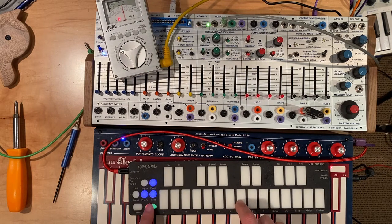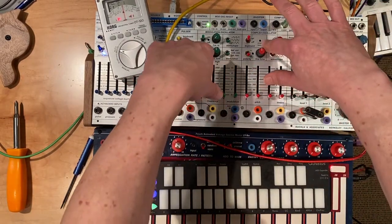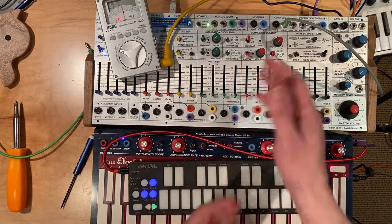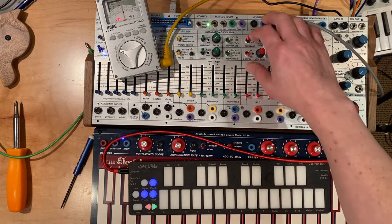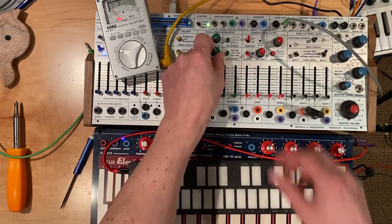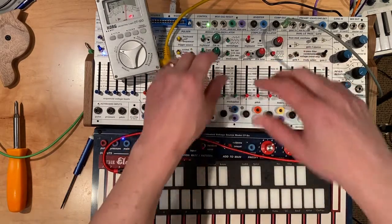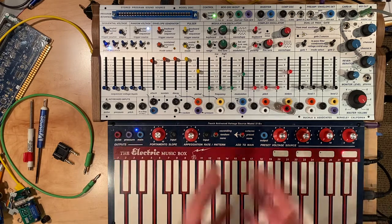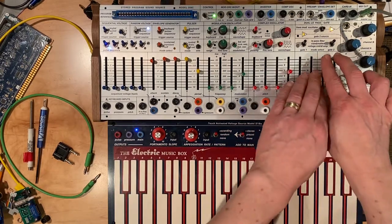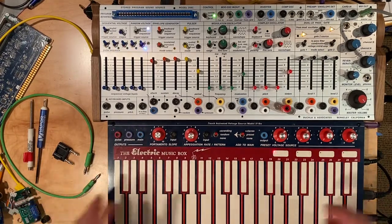Going up to C8 — it's pretty good. Thanks for watching. Most of the time, if you're going to mess with tuning, mess with these two trims only. This is a tracking trim; these trims are what we use to keep C1 centered. If your system's a little bit off, it's okay if it's down there — this is a pretty wide range, so you shouldn't fret if your C1 is a little sharp or flat. Just use your ears if you don't have a tuner. Tune to a piano, tune to whatever you want. Tune one of the oscillators and make sure the other oscillator is likewise in tune, and then the main point is to get them to track equally.